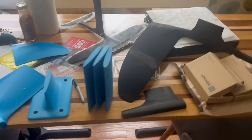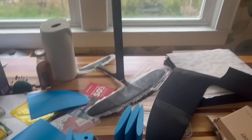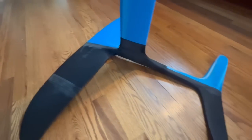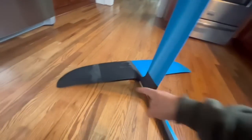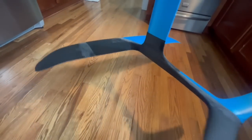All of the full-scale hydrofoil parts have 3D printed out. I ran out of the carbon so I just had to use this blue Matterhackers PLA, and I'm going to glue it together now. There's the 3D printed full-size hydrofoil, all super-glued together. It came out a little crooked — there's a little bit of warping. Even with PLA, once you do these bigger pieces, a little bit of warping happens. But man, this thing's going to be rad. I'm going to put some fiberglass on it and maybe some carbon on the joints, then give it a try.